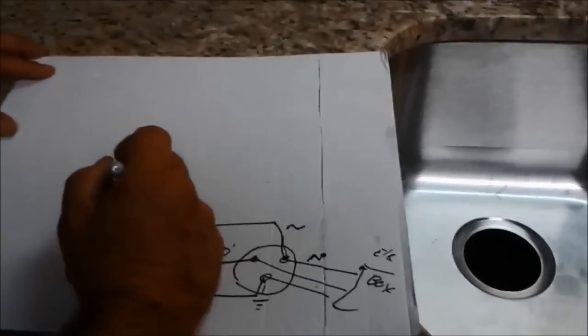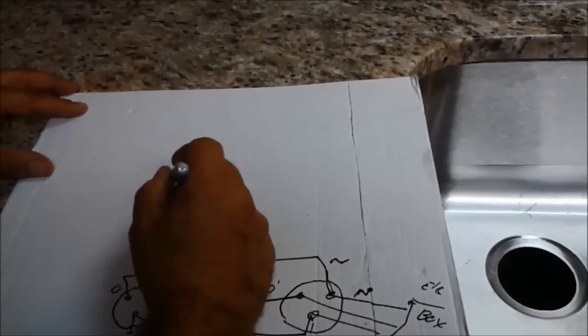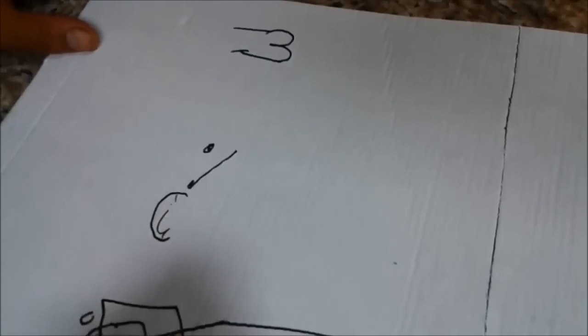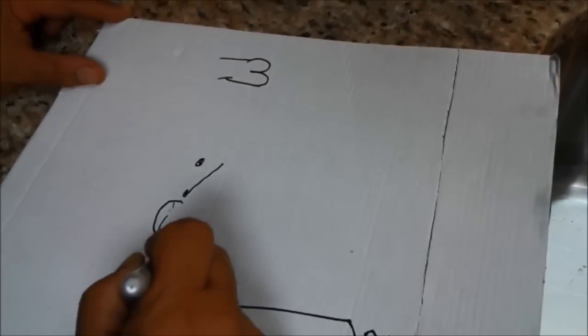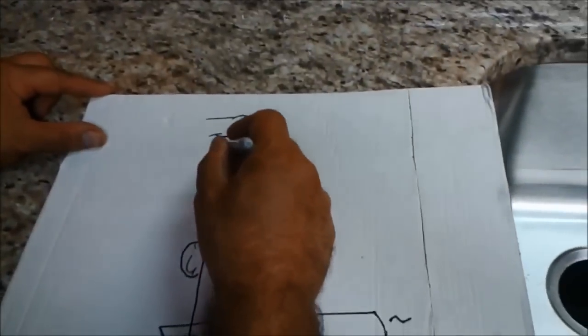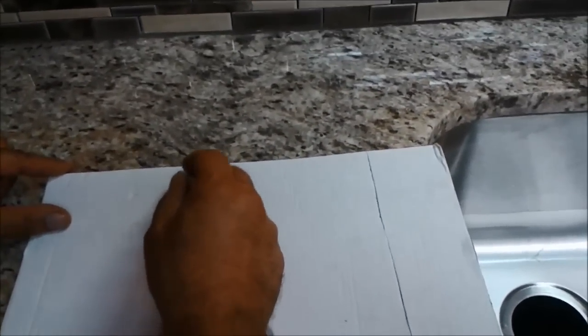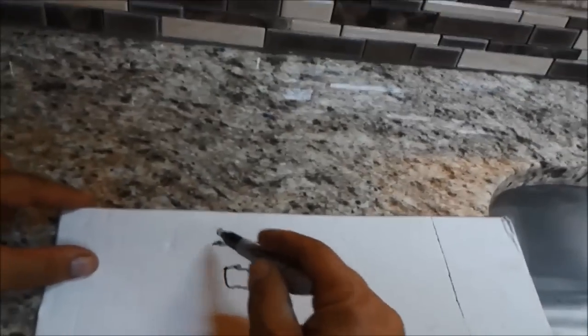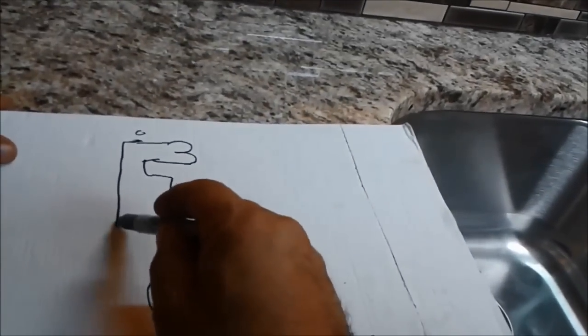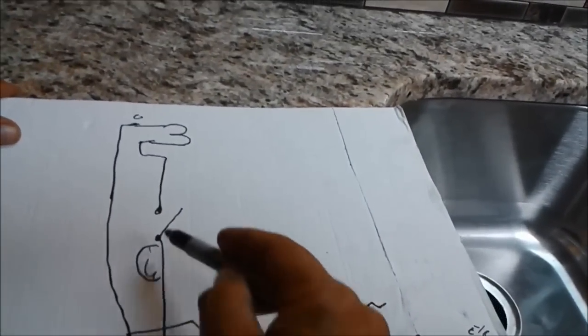Now what I am going to do here is the switch. To make a switch I am going to do it like this — here is the light, each one has two wires. To the switch I always have to take the hot, because the hot is the one that carries the current through it, and from here it is going to the light. The zero should return the current to the source, so the zero goes to the zero.